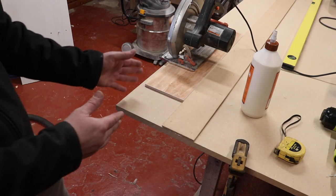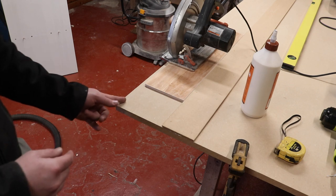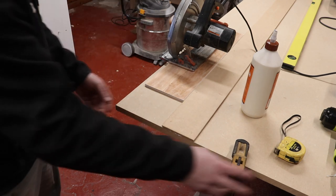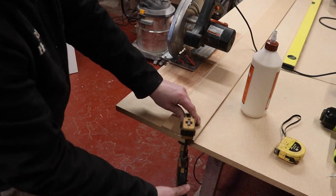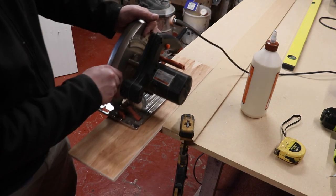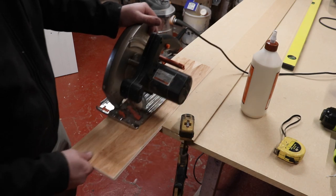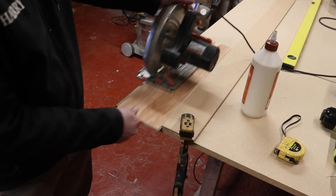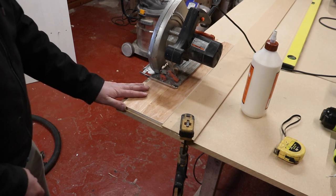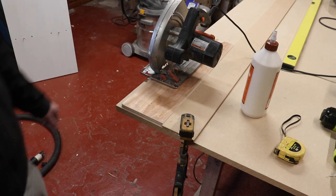When we come to do a cut on a piece of plywood or MDF at 8 foot long, we just line up this edge here with our pencil mark that we want to cut, clamp the whole thing on with a couple of quick clamps like this, provided that they're out of the way. As you can see, they pass that quite easily because I made that deep enough, and then you'll be able to just cut her off. So let's just finish this cut here, and then I think all will be ready for the first run.